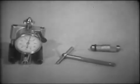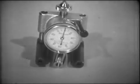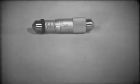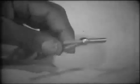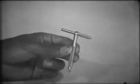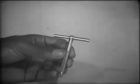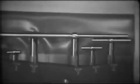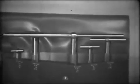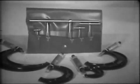Some of the instruments used to take inside measurements are the dial gauge, the inside micrometer, and the telescope gauge. Telescope gauges normally come in sets that allow you to take a large range of inside diameter readings. An outside micrometer is used with the telescope gauge to obtain the reading in the thousandths of an inch.